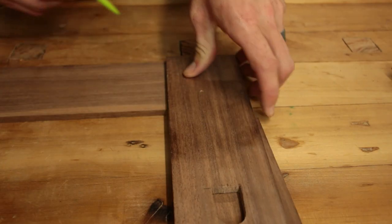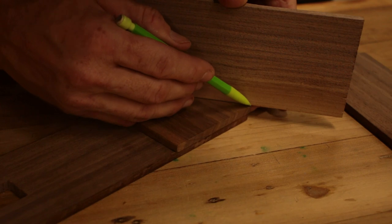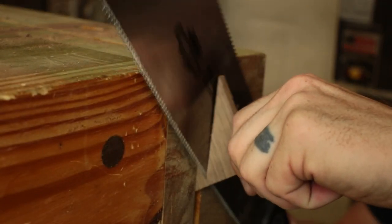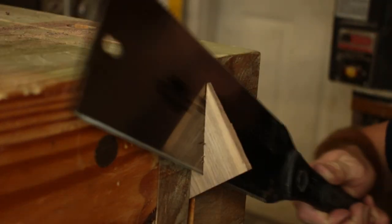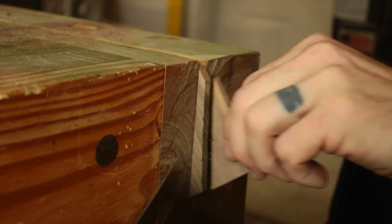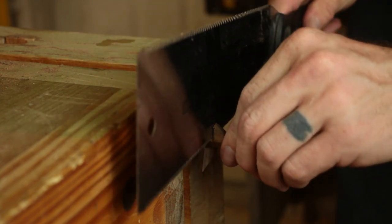Now because this is only quarter inch material that I'm working with, I'm a little worried that because I'm gonna be gluing these together in this kind of orientation, there's gonna be a lot of leverage on these joints. And so I wanna try and reinforce these joints as much as possible. I'm gonna do that in a couple of ways. One of the ways is I'm going to add a lot of shear strength with these diagonal pieces, and the other is I'm gonna add a little bit more of a glue surface by making a few triangles that these are going to sit onto.